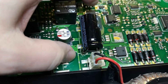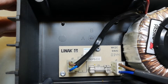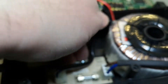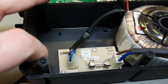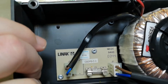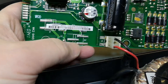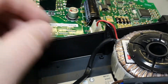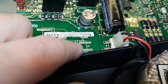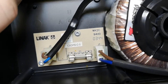They still love these really really big capacitors. And the fuse is on a separate board. This is because this cable can't just go straight out when you need a fuse somewhere, so you need a PCB and a few sockets and connectors. But they prepared for it — see some connectors and a fuse here. The transformer could have been connected here with an SMD-type socket, and the fuse could have been here, to save the cost of all this assembly.